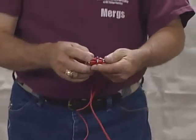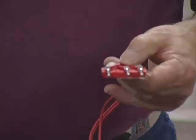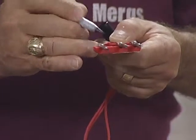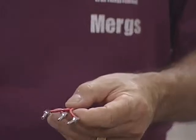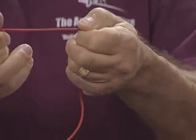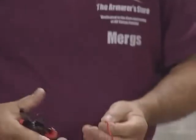Inside the connector you can see the three pins in their locations. It's important when you take it apart to remember which is the C line. I take a magic marker and put a mark on that particular line to remind me where it goes so you don't end up switching them when you put it back together. We determined the A line was bad. Pull it, and you will see a thinning of the insulation — that's where your break is.